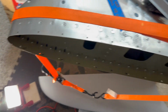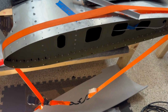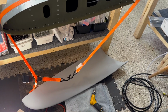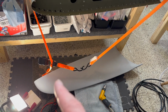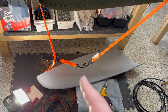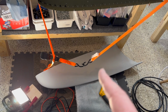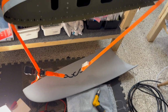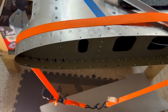Yeah. And so, what else? Well, let's get this part done. There's still a whole bunch of work to do, right? So once the holes are drilled, there needs to be countersinks done. So 120 degree angle drill bits for countersink, and they're going to be the 3.2 millimeter countersink, right, on those. And then all of these dimpling is going to happen as well.